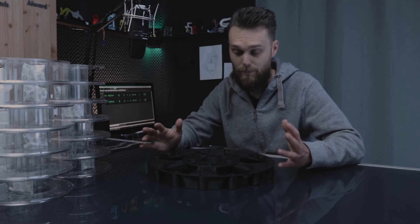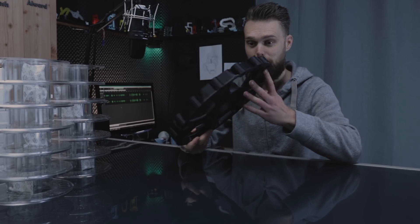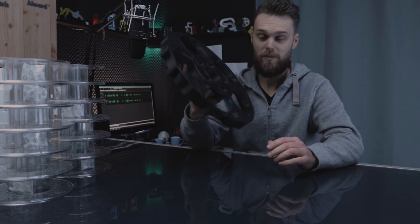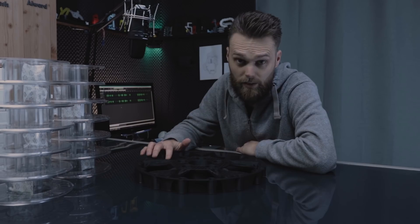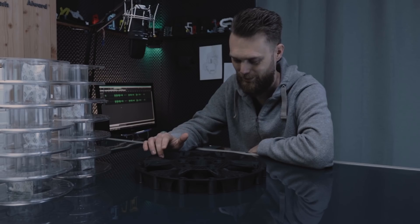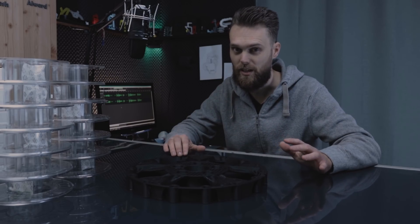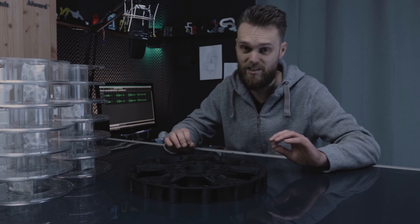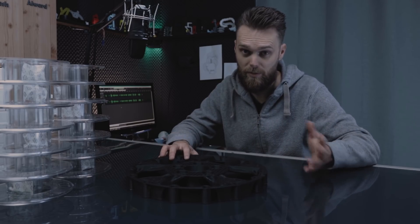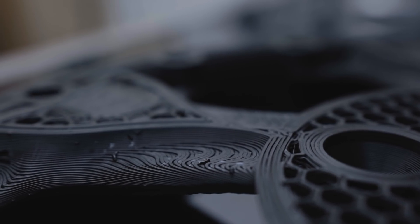On the positive side, the printer is running reliably and stably — I can print large things out of ABS, which is awesome. I'm very happy it managed to print the outer rim and the hub. I can see if this fits on the car, though I don't have enough material left to print another full rim. I'm going to discuss this with 3D4Makers to see if they can deliver bigger spools, and I'll find a reliable, accurate, and easy way to join the filaments. If you have a suggestion for joining ABS reliably, let me know in the comments. This is still an impressive print — these layer lines look awesome, just like a height map.